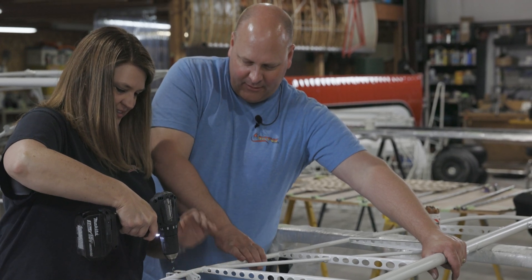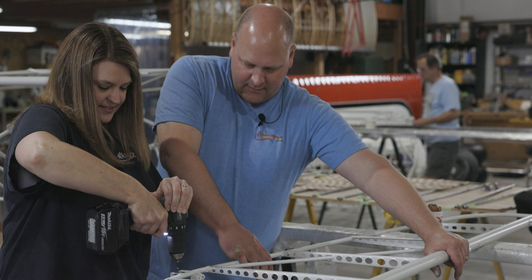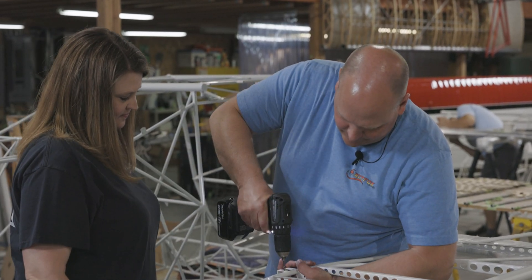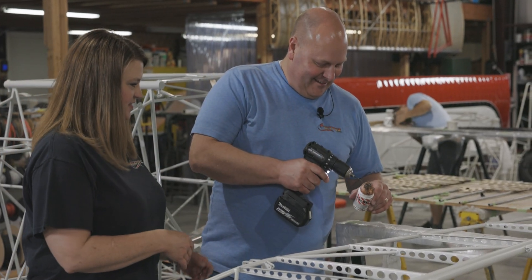Take your hand off here and put it on top of the drill — gives you a little more control of pressure. Sometimes you can have a little piece of steel on the end that screws with you. It was there — you were almost through.